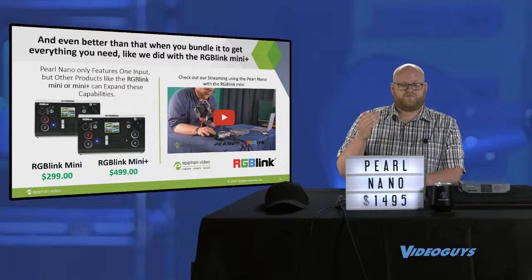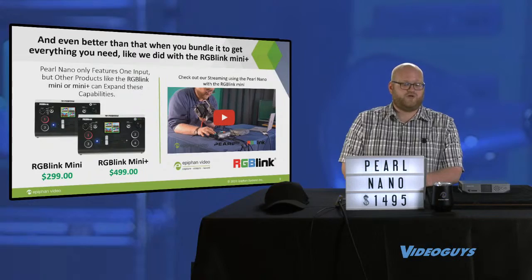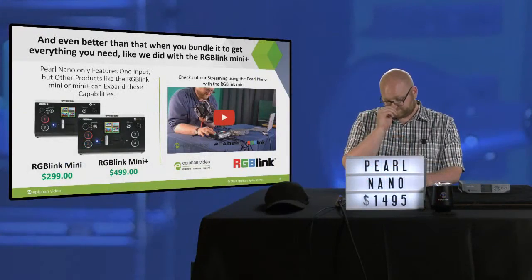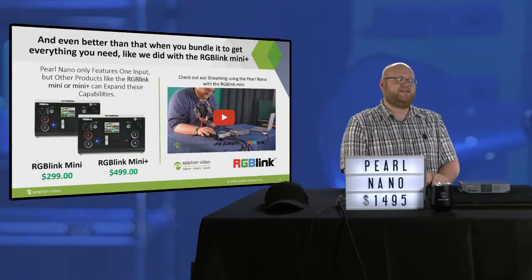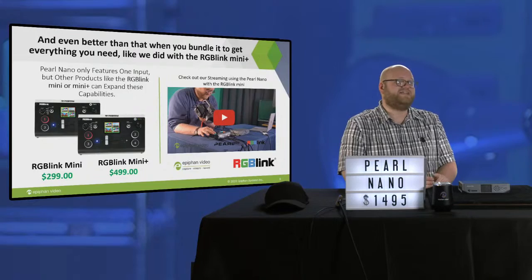So since the Pearl Nano only features one channel, you could plug in a video switcher and use that to cut between different cameras while still maintaining one channel within the Epiphan Nano UI. Now, what do we recommend for that? I highly recommend, if you're looking for a very inexpensive solution, the RGB Link Mini and the RGB Link Mini Plus. Now, to be clear, with the RGB Link Mini Plus, you even have PTZ control over that. So you can add possibly even more angles and production value to your streams as you go along.